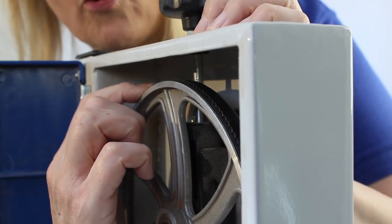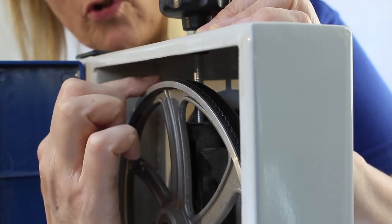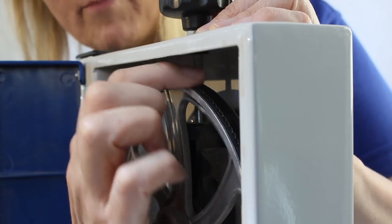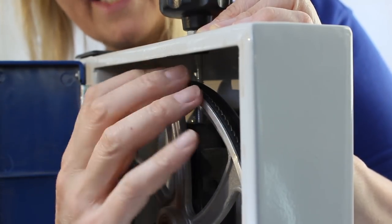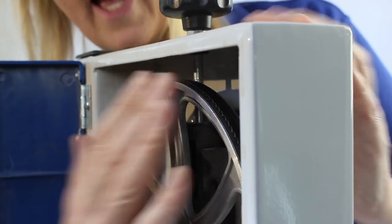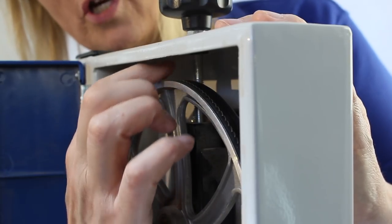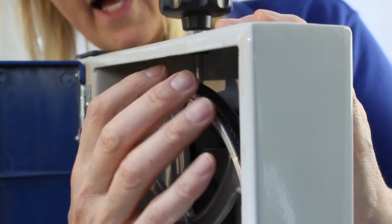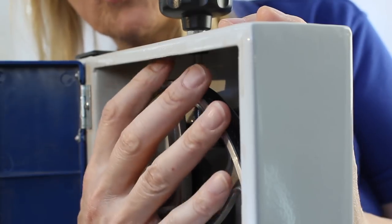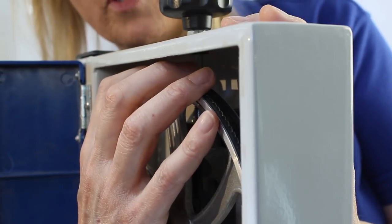I should explain what I meant by that crown comment. There's no crown on this wheel — the cross section is square, it just comes straight across. There's a rubber tyre but it has no curve to it; the wheel is just a rim with a flat piece of rubber in the middle. On better quality bandsaws there's a curve to the top of the wheel, which naturally centers the blade — the same effect as the wheels of trains staying within the middle of the tracks.